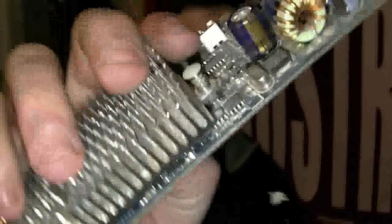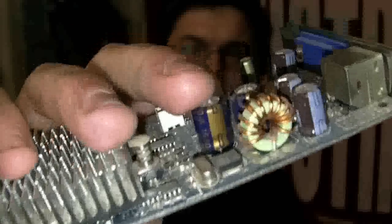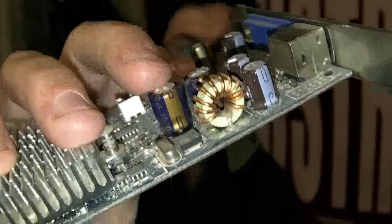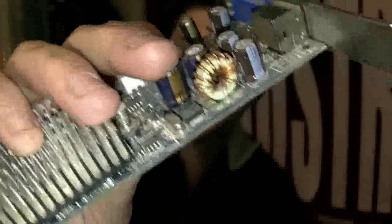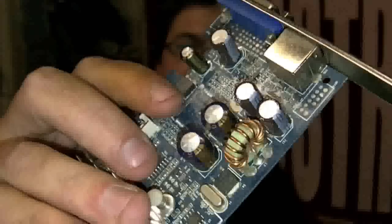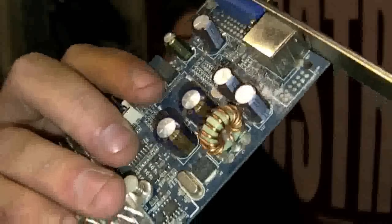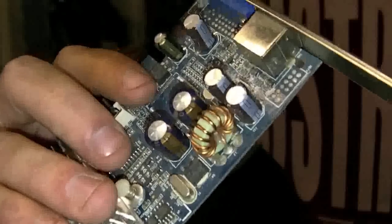This is a video card I've got in my hand. Even by feeling, by touch, you can feel that it's bulging out, and chances are that something like this will be stopping your computer or your motherboard from starting, or even causing random crashes where it's not working right.